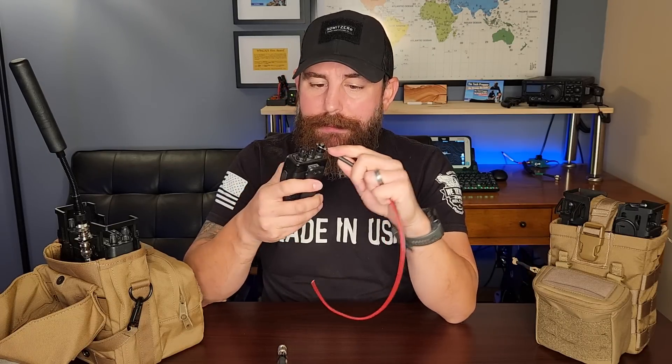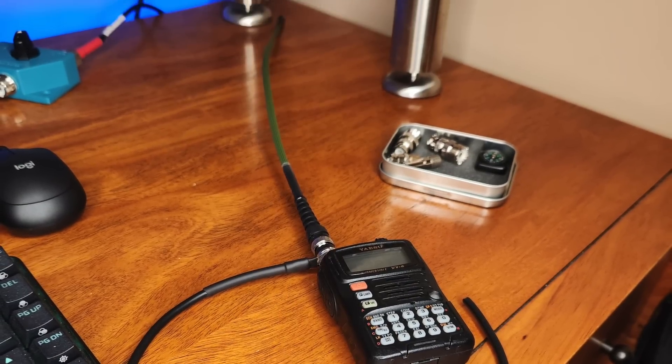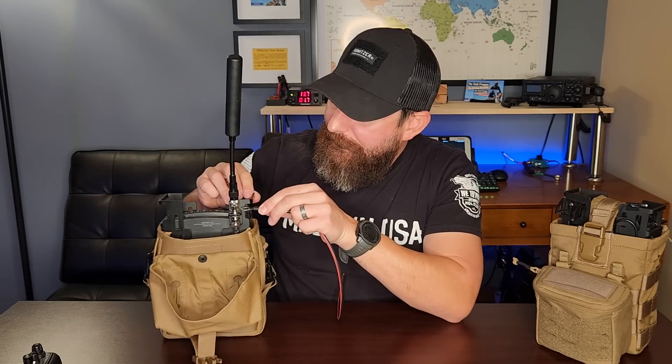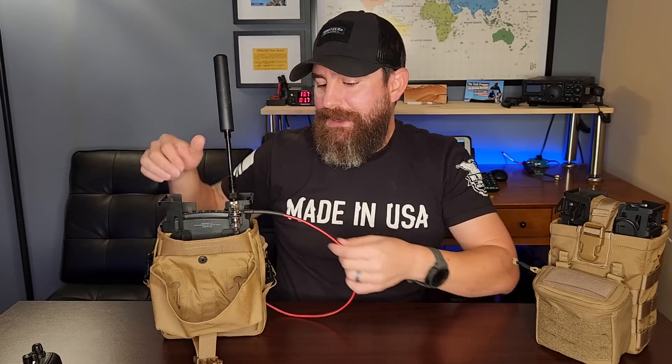There are a few ways around that depending on how you want to experiment. A lot of guys insist the best way to get performance out of your HT, in addition to your body acting as ground, is to create something called a tiger tail. I'm using an eyelet here, putting it over the shield side of the antenna — almost like a dipole, we have two halves of the antenna, and this is how we get better performance. I've experimented doing the same thing on the manpack and it helps quite a bit, using about a 19 and a quarter inch system. If you're using a BNC connector, you can take this off and run it that way, and use your SWR meter to see if it actually helps.